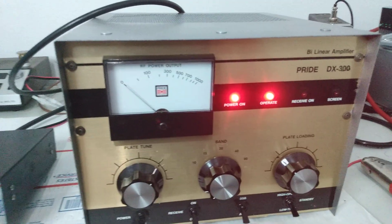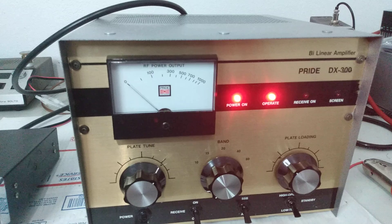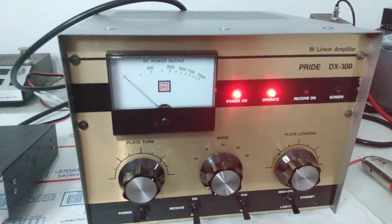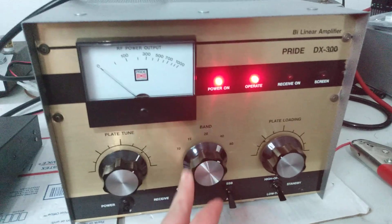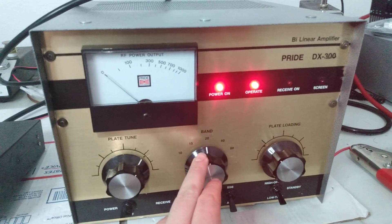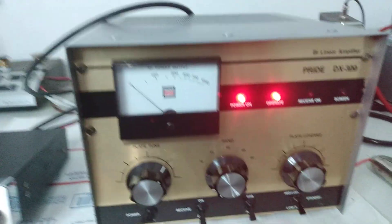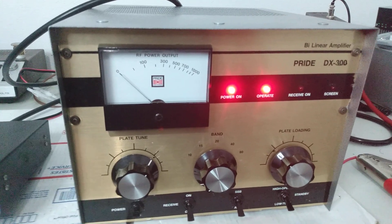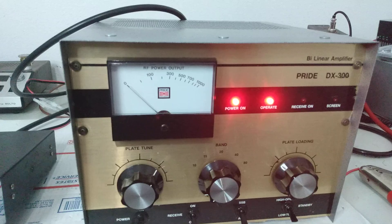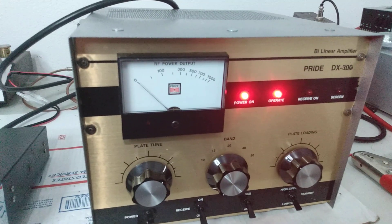That's it guys — you can call it a super pride, JTG pride, whatever you want. Probably one of the nicest ones I've had come through here. If I was going to keep one to talk on, this would probably be it just because of all the stuff that's been done to it and how it works. The band selector has been disabled to have this variable in it, and it basically works like a true variable until you get back in a certain area and it starts coming back up a little bit. But you get a good bit of variation — we had it cut from 1,250 PEP down to around 550 PEP. The key is don't overdrive these things and they will last forever. I think everybody that gets them and runs them appropriately will tell you they're probably one of their favorite amps they've ever had.